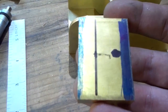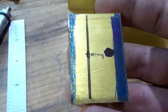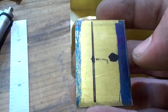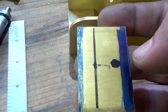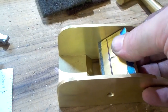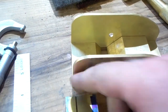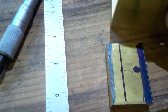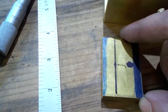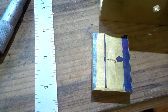Go ahead and size up your cap - it's about one and three-eighths long. The width you want about five thou less than the sole so that it fits in there with still a little bit of wiggle room. You can mark out where the quarter-inch dowel pin is going to go through, and this is going to be a three-eighths tap for the screw.